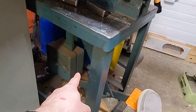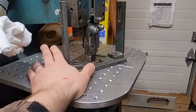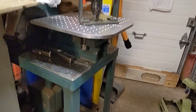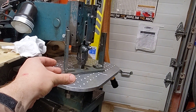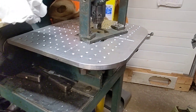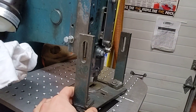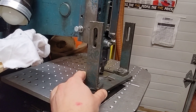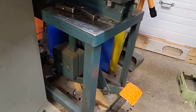Then it swings back on this weight to lift the tool. And this is called a stripper plate. The stripper plate holds the workpiece down and strips it off. So the piece I cut — this one is what I cut around — the stripper plate goes here, attached up there. When the cutter went through, the stripper plate holds it down and then strips the tool right out. Very amazing tool.